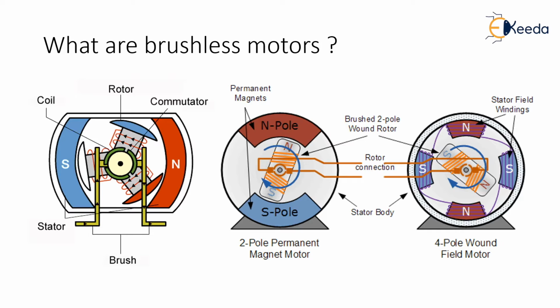The rotor holds a collection of permanent magnets which are positioned in close proximity to the semi-permanent stator electromagnets. Attractive and repulsive interaction of the stator and rotor magnets is translated into rotational movement. When assembled, the shaft of the rotor is inserted into a pair of ball bearings located in the stator that maintain linear, smooth revolution of the rotor. Although the brushless motor is powered by DC current, it can't be driven directly. Instead, the brushless motor is wired to the control electronics, effectively eliminating the need for brushes or a commutator.